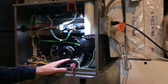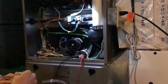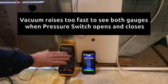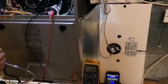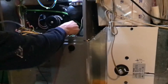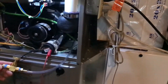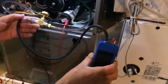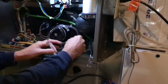That'll tell us when the pressure switch closes. Now to check for the pressure, we want to creep up on it — not just have it go all at once — because it's too difficult to watch two meters at once to see the precise moment the switch closes. So our first connection will be inside here to get vacuum when the inducer fan runs, then we go to our valve, from there we tee off to the AAB SPM100, and then connect to our pressure switch.